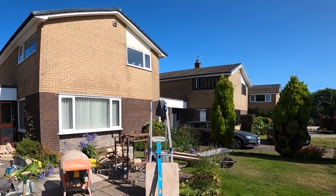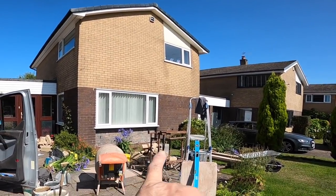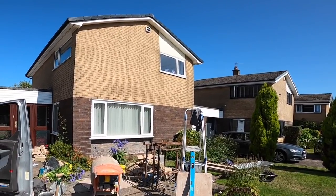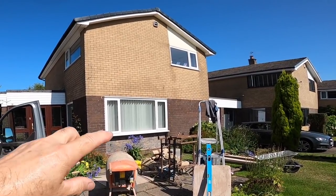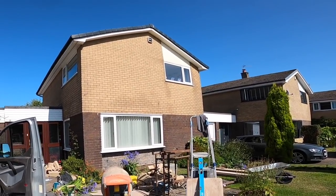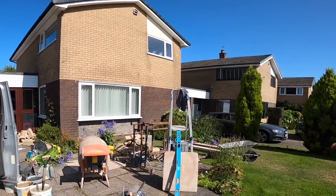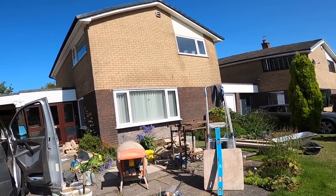Sand and cement, non-existent cement in it, no ties in it whatsoever, so we'll be tying in a tie at each end. We're going to put a couple in the brickwork as well, and we're going to make sure it goes in high and they slope away from the brickwork, from the inside skin, because I had so much hassle about that on one of our old videos. One little mistake and I got crucified for it. So as they say, you learn from your mistakes.